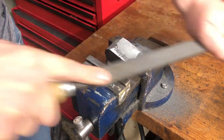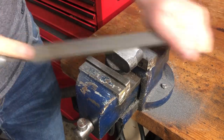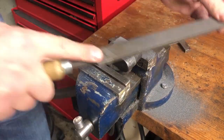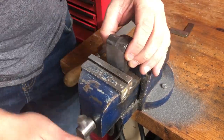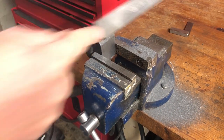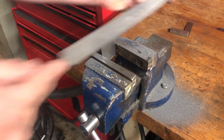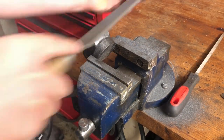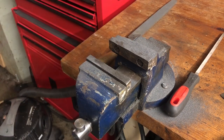To be honest, with the amount of material that I am removing here, there is unlikely to be any of that cast surface left at all. The two cast sides are not parallel, and so I have chosen one that looks the nearest square, and I am using that one to occasionally check that I am not drifting too far from the original shape. Having made a start on cleaning this up, I am inclined to think it would be both easier and faster to fabricate this from two pieces of bar stock, but in the spirit of the project I will persevere with the cast part as supplied.